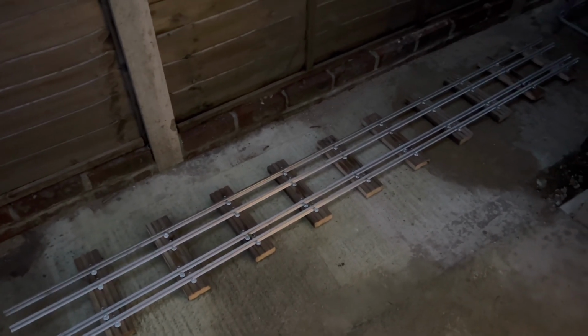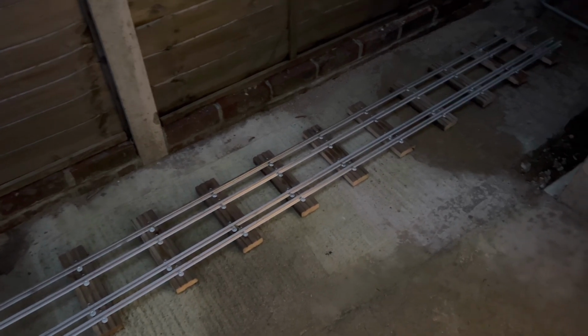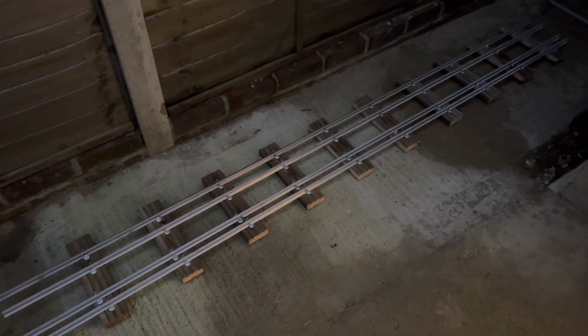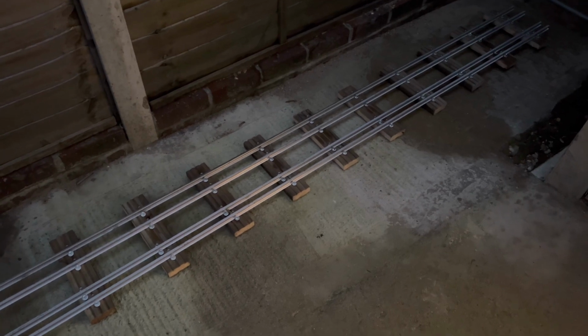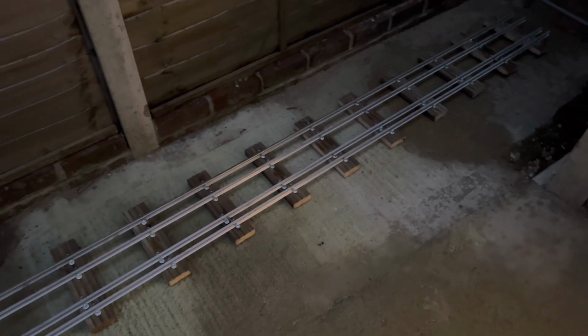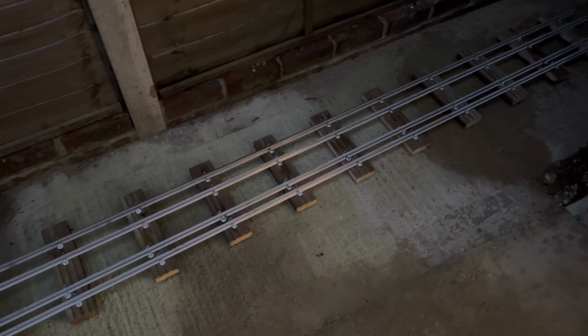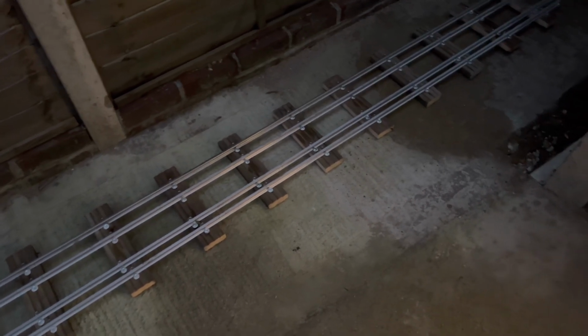But that being said, 2.5 was always a push anyway, let's be honest. But the 7, the 5 and the 3.5 is a winning solution. Yes, we know the sleepers could be wider, but it's plenty strong enough at 9-inch spacing. There's nothing wrong with that. This path isn't the flattest or the smoothest, so it does bend, but that is also fine for the purposes of a garden testing. So we could use this method with these fixings to go bigger.